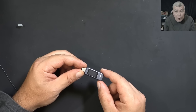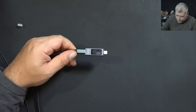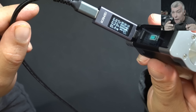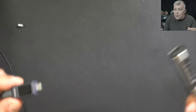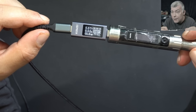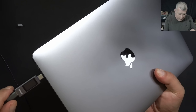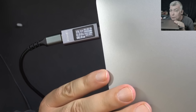The next one is the USB power meter — a must-have tool in repairs. I'm going to plug in a USB-C cable and test it. Check there — it's showing the voltage, the current, and also the power. What I'm using right now is drawing 280 milliamps. Connecting a different tool to the USB meter: five volts and my tool is taking about 600 milliamps. Now let's check it on my laptop — I have a faulty MacBook here. Plug in the USB meter.